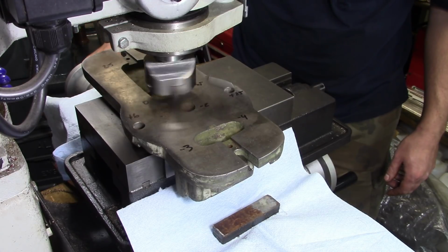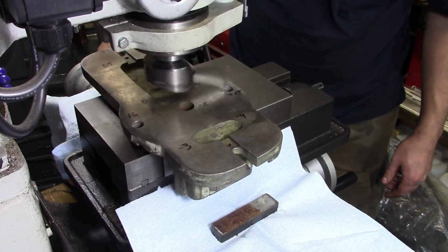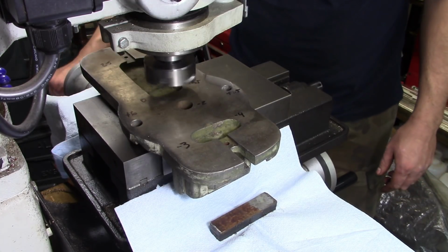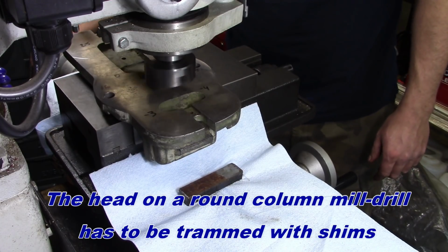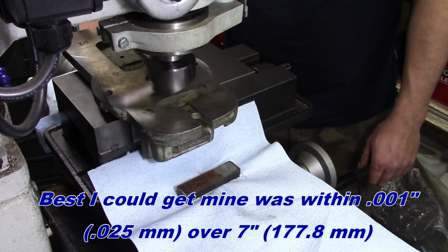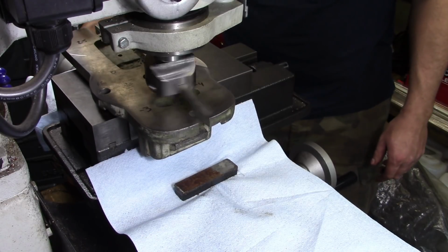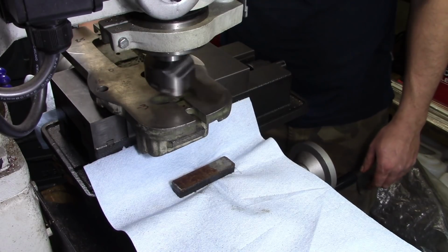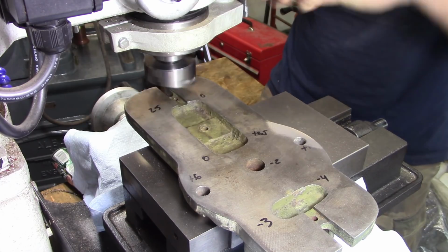Sad to say, it does look like there's a wee bit of chatter in the lines that are cutting. One can't be too surprised about it. I guess with a fly cutter this far out, that's kind of why I'm getting a bit more scratch on the back pass. Let's add a bit more feed.